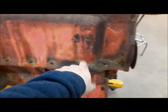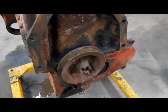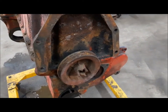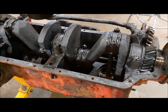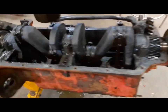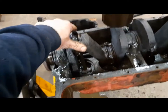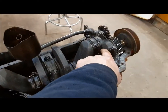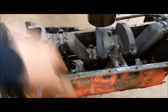There's bolts all the way down each side of the oil pan, and don't forget there's two in the front under there. Just whack it with something to loosen up the gasket and it should come right off. We've got the pan off now. It's not really all that bad in there. I've got the crank turned so number one and number four are at bottom dead center - we'll get these two out.